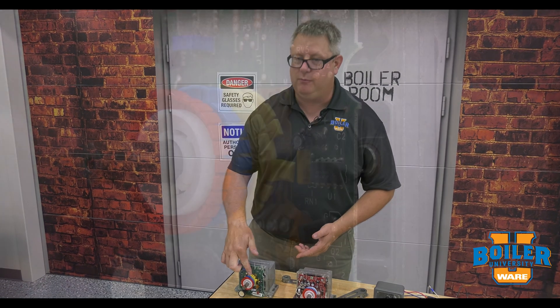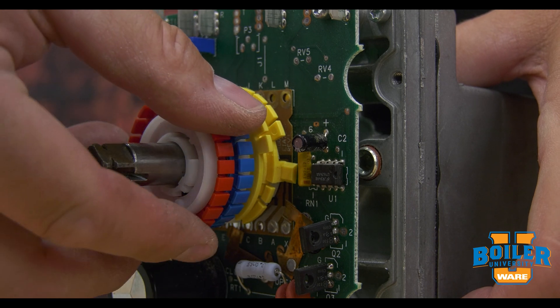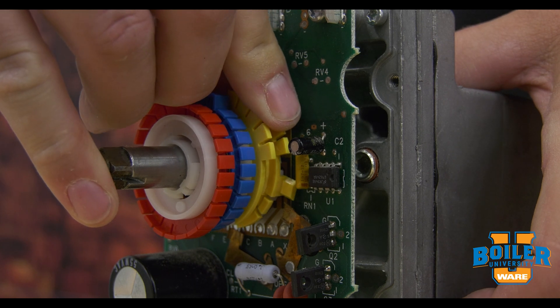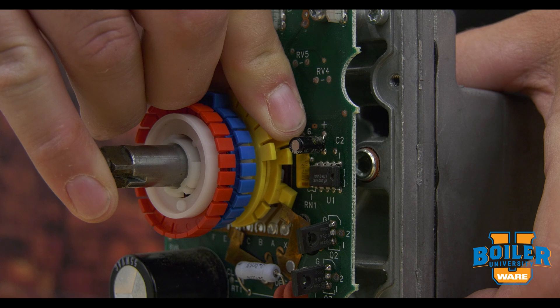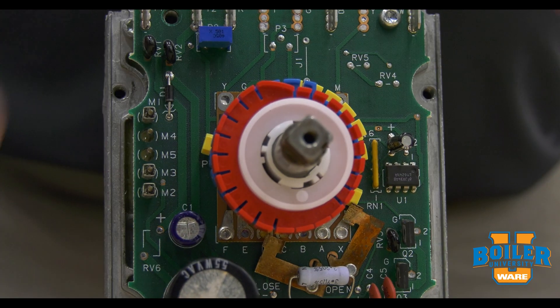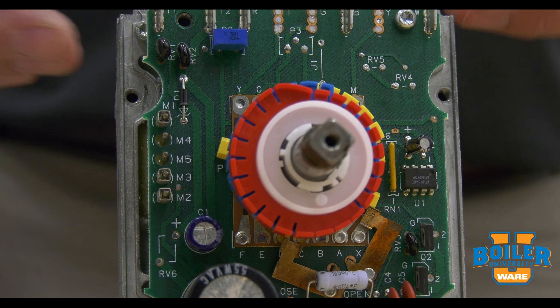The key is these yellow cams. As the motor turns one way or the other, these yellow cams approach the end-of-travel limit switches, and when that lift raises the switch, it stops travel in that direction. There's a yellow travel cam for each direction, so when they're extended fully, they shorten or cut travel off both ends, giving us a 90 degree rotation.